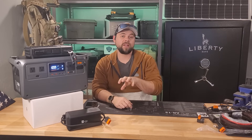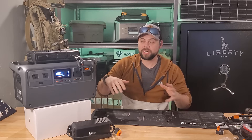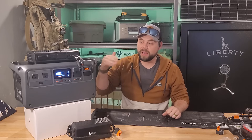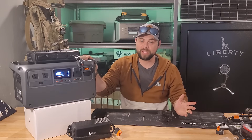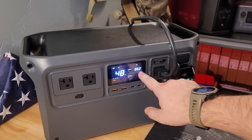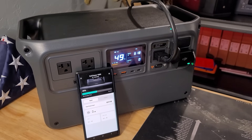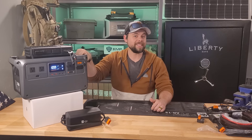The 60-volt input limit is similar to what we've seen on the Anker Solix F3800, and that's definitely a thumbs down for me. I prefer to see at least 100 volts on a charge controller, preferably nothing less than 150 volts. But we have to consider this is only a 1000 watt-hour battery, so whether wall or solar charging it'll be easy to get fast charging into it. This is more just for portable easy power — it's not going to run your whole house.